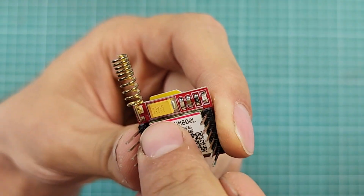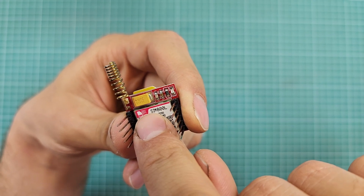The next point is wires. Use strong wires and traces to power the module. If you are wiring the module on a breadboard, use high-quality, low-resistance wires, or double the wires connecting the power sources to the module. If you are designing a PCB, widen the traces connecting power sources to the module. Also, ensure to use a high-quality breadboard, as the quality of the breadboard itself is very important and sometimes is the root cause of module failure.